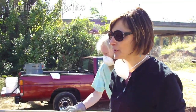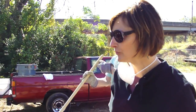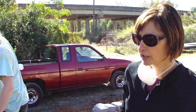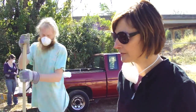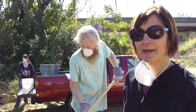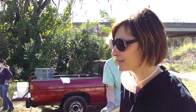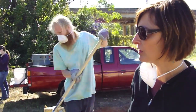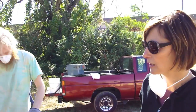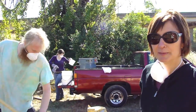What we're doing this morning is filling the area where the chimney for the wood kiln is going to go. It's approximately 4 by 4 feet and 10 inches deep. This is taking about 21 bags of cement and the bags are 80 pounds each — pretty heavy. We're using a wheelbarrow and a trowel and we have a cement mixer for mixing. We should have this done in about an hour.